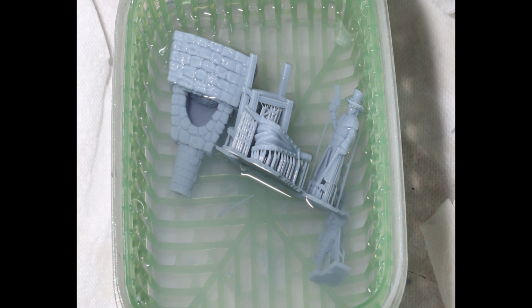In my rush to print this out, because I was going on vacation, I actually placed those ultralight supports and committed a cardinal sin I always tell you guys not to do, which is I let some of those bond to the model. And that's why you see that little wave there, because it actually touched the model and then came off.